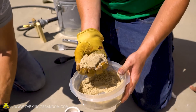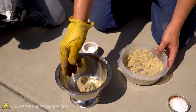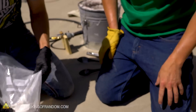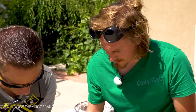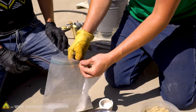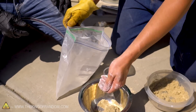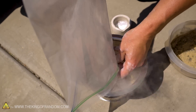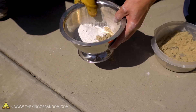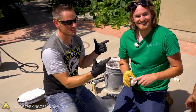Since the sand is still a little wet its weight is going to be off, so there's no sense weighing it — I'm just going to mix together an equal volume of sand and sodium carbonate. It's like a one-to-one ratio, although we only need about 20 to 30% sodium carbonate. The more of this we use the lower the melting point will be and the easier it will be to melt. This is the kind of cooking I enjoy — cooking with recipes from Cody's Lab.